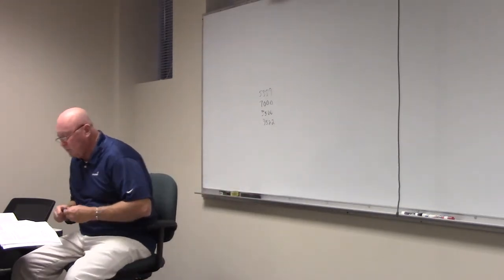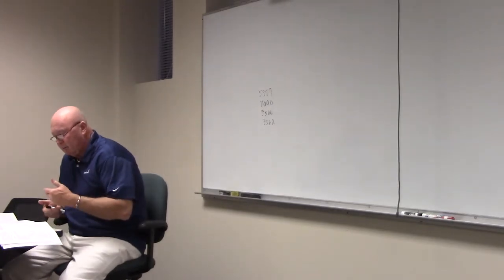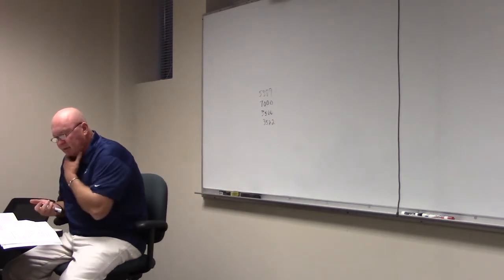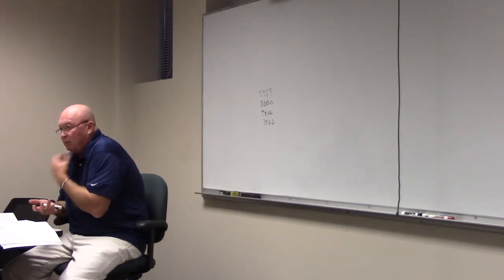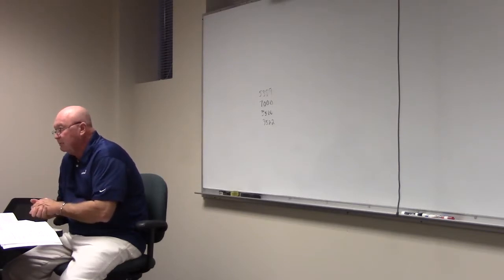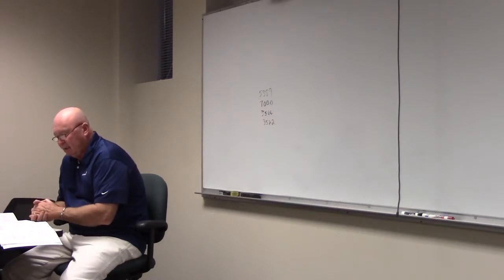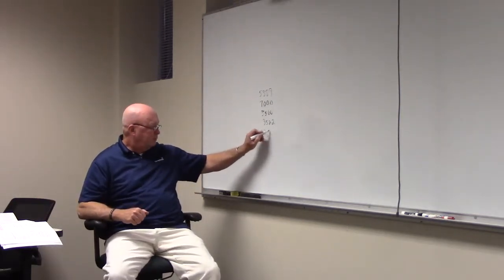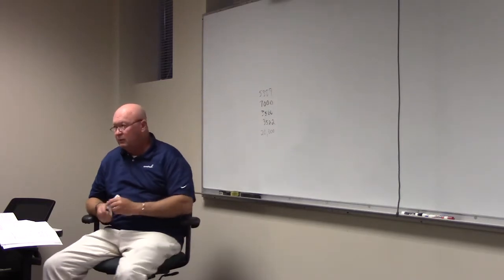All right. Step seven, we're doing heating or air. So the heating load, it says there is 20,000. We see that it's 20 kW. That's how many watts? 20,000 watts or 20,000 volt amps, right? The cooling load is 25 amps times 240, and as you see there, we did the multiplication, it's only 6,000 VA. So we're going to take the larger. So we're going to take 20,000. Y'all see why we did that?